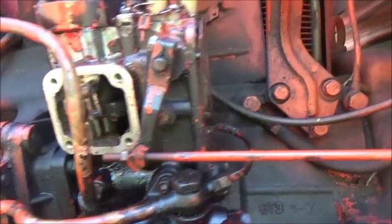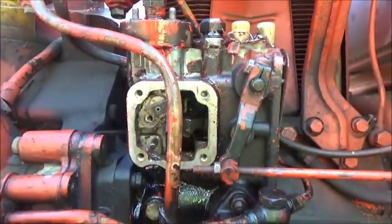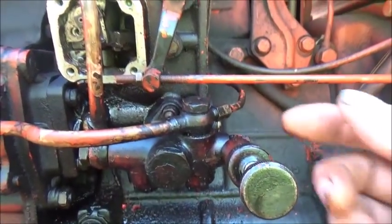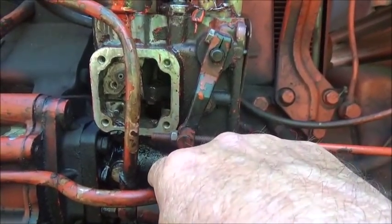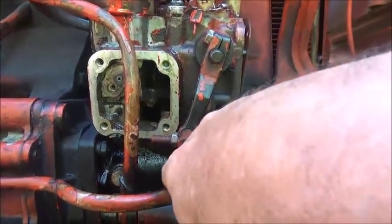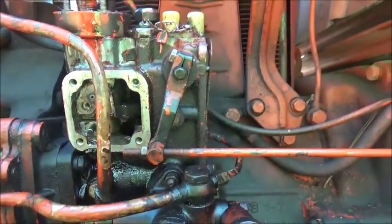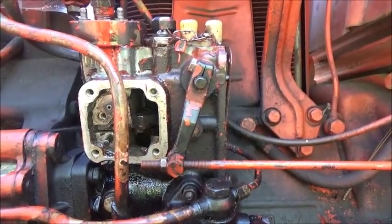I think we can take the governor apart, take this off, take part of it out of the top. This shaft is a two-piece shaft. It's got another cam lobe here to operate the fuel pump, bearing back here, cam lobe, and then the gear, and then a coupler, so that it's a two-piece shaft. The gear is going to be right in here because the governor travels right here. Then there'll be another coupler here. So this shaft should actually come out the back side, and we should be able to replace this and fix it with it on the tractor.